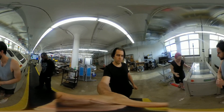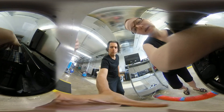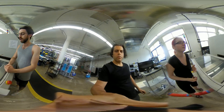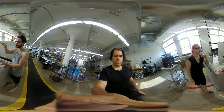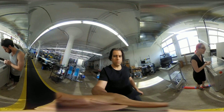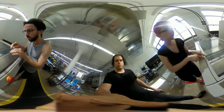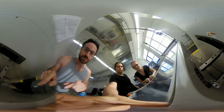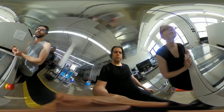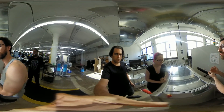The board loader is a fantastic machine. It's really simple, but it saves us a lot of time having to load each board manually. You have a stack of boards — 50 to 100 boards — up against a little metal piece. It grabs one and slides it through. There are sensors on this conveyor and on the next, connected by a cable called SMEMA, which allows it to recognize when to feed another board as one advances into the next conveyor.